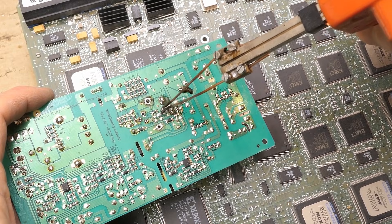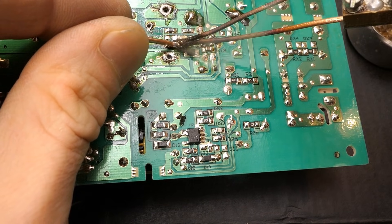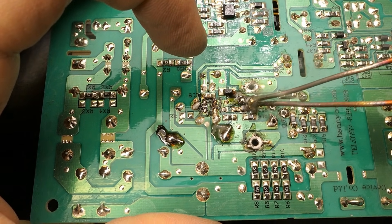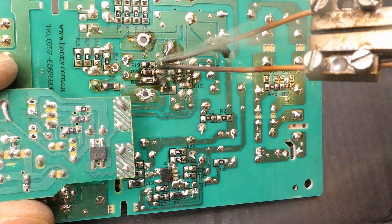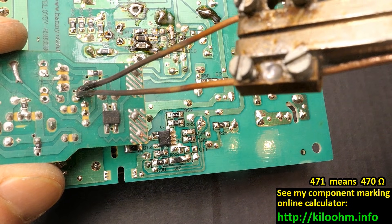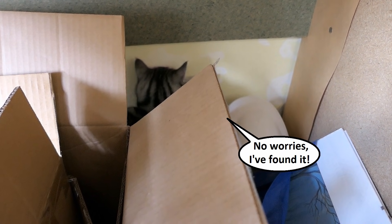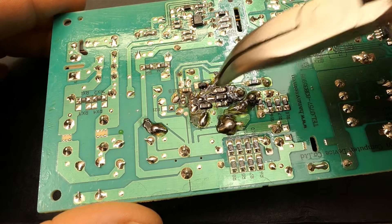And the diode. Placing the 68-ohm resistor into its spot — that's absolutely the right tool for it, isn't it — and the other side. Resistor is in place. The 10-ohm resistor goes here. The blown 470-ohm resistor has to come out, a donor resistor is fitted, and the diode from a donor board goes in.